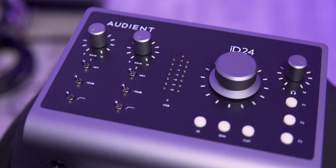I need way more outputs and inputs, and this is where the ADAT expandability is going to be very useful — adding an extra eight in and out channels. The small catch is that I'm going to need extra converters to convert from digital to analog and back. In my case, I'll be using my Lynx Aurora 16, which gives me an extra 16 inputs and outputs. A cheaper alternative is to combine this interface with the Audient EVO SP8, which gives you an extra eight channels and goes out at $499 US.